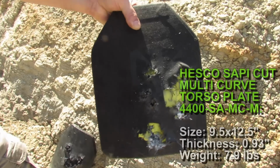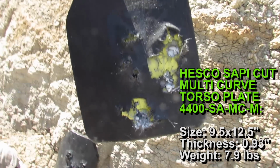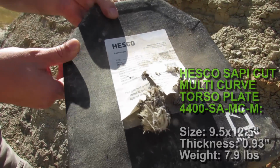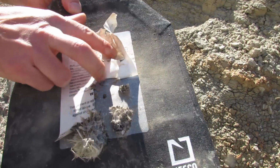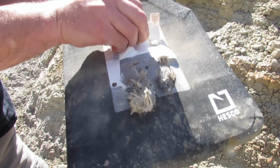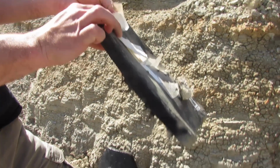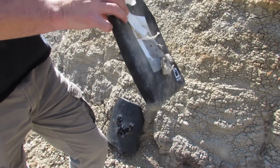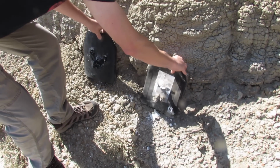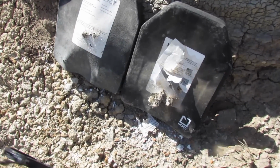You can see that the Cordura nylon fabric wrap actually was compromised relatively early in the testing, and the bullets were able to actually get all the way through, and it was able to blow a hole, and the material was completely removed from that void. As we talked about earlier, nature abhors a void, right? And so some of the materials, if it's able to be contained in a different coating like polyurea, seem to have been held into place, and maybe that's what added to the continued ballistic protection, was the elasticity of the coating.